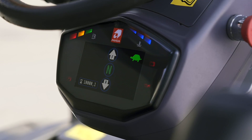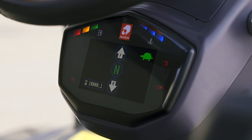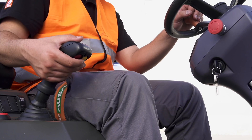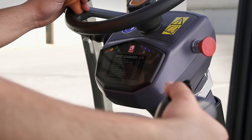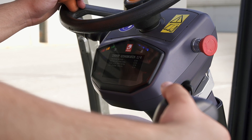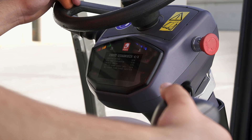The digital display, as well as showing all basic information such as the gear or fluid levels, also has a self-diagnosis mode, which can be easily accessed by simply starting the forklift and pressing a button on the joystick. From here, the operator can check any error codes and inform the technical service so that when they visit the machine on-site, they can perform the necessary tasks quickly.